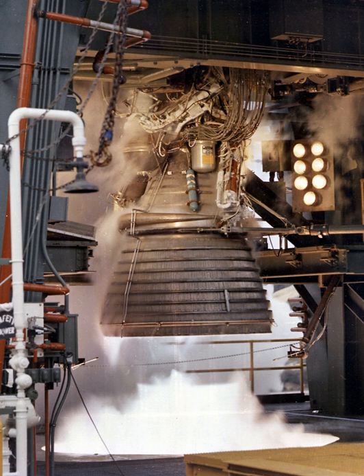One static and two dynamic seals in series prevented the turbopump oxidizer fluid and turbine gas from mixing. Beginning turbopump operation, hot gas entered the nozzles and, in turn, the first-stage turbine wheel. After passing through the first-stage turbine wheel, the gas was redirected by the stator blades and entered the second-stage turbine wheel. The gas then left the turbine through exhaust ducting, passed through the heat exchanger, and exhausted into the thrust chamber through a manifold directly above the fuel inlet manifold. Power from the turbine was transmitted by means of a one-piece shaft to the pump, where the velocity of the LOX was increased through the inducer and impeller, converting velocity to pressure.